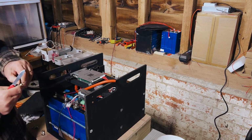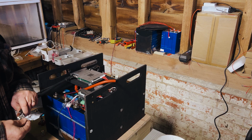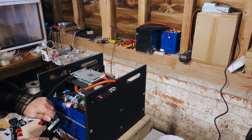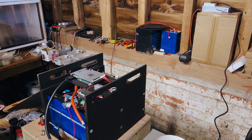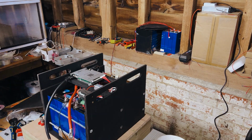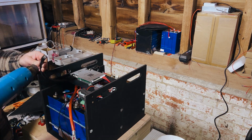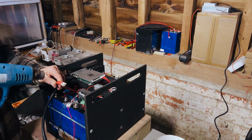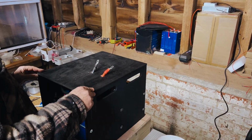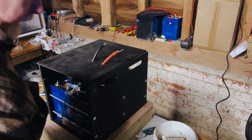on. So we have a couple of holes where the main positive and negative cables go through the lid. The customer specifically asked for the bus bars to be mounted on the lid of this battery. We've put them all over. Sometimes we put them on the side, sometimes on the lid, sometimes they're in a recessed lid, so that there's a bit of protection from something landing on the top of the battery and then shorting the terminals, that sort of thing. So yeah, we're pretty flexible with the way this goes, and usually you're really not putting a lot of distance between your BMS and your main positive terminal and your bus bars. So in terms of the amount of current you can carry, it does make a huge difference in that regard.